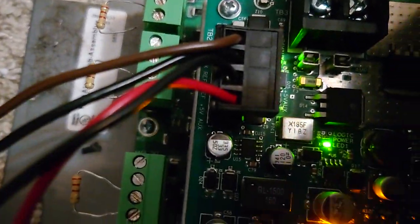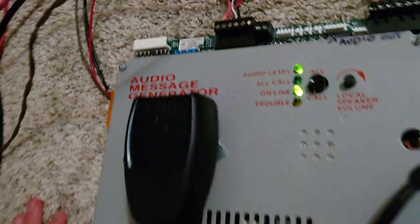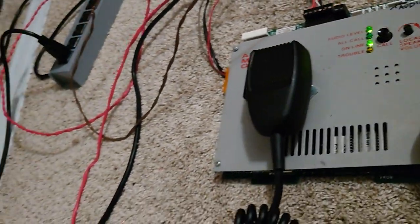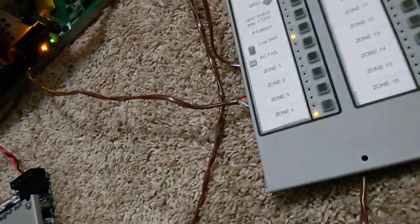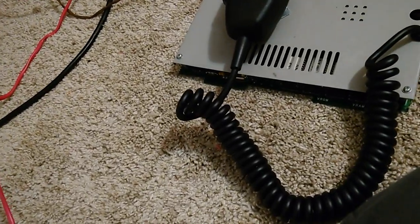That first one over there is for your 5 volts. 5 volts is for this leg and that one, so you have that red wire going over there. Then you can put two commons on those middle ones. And then you put the 24 volts — which is brown in this case — for that second one. You want to double check that these are actually going to where they need to be. This is how it works for me — I cut off all the excess cables.